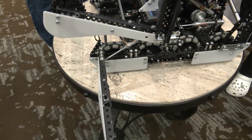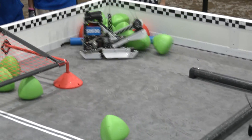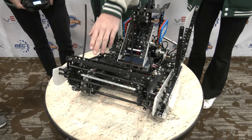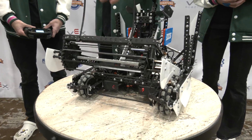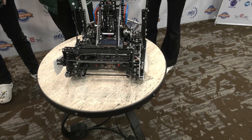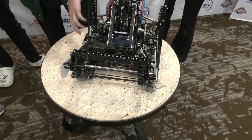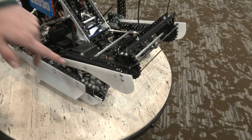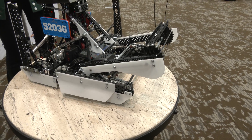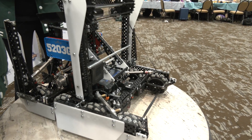I just got to comment on what a gorgeous design this is overall — this is a very aesthetically pleasing robot. I love robots that aren't just functional but also look great. Connor, as we move on, let's talk about the intake and also you've got a double hang as well. So we have our intake — we really focus on the actual mechanism used to grab the tri-balls. We've tested different mechanisms with flex wheels and other things, but we focus on rubber bands because they allow us to conform to the shape of the tri-ball very easily and hold on to it tightly. These plexi guides on the side are curved to help us lift the intake up when we drive into the goal, then angled down to slide over it, so they can pivot all the way up when we're pushing tri-balls in. We can use this brace in the middle to jam the tri-balls all the way into the goal really easily.